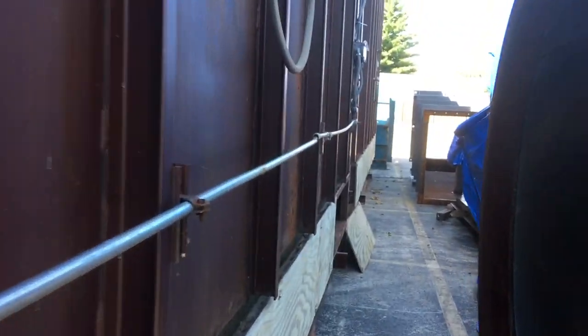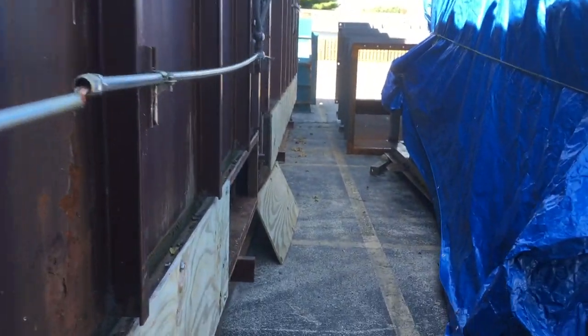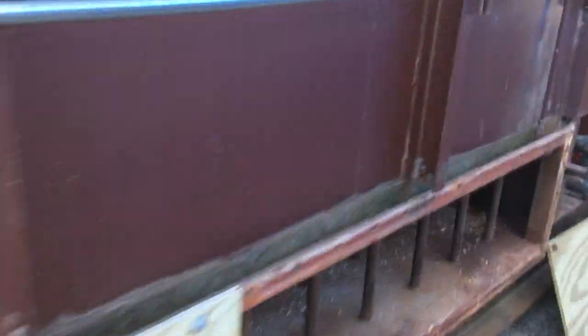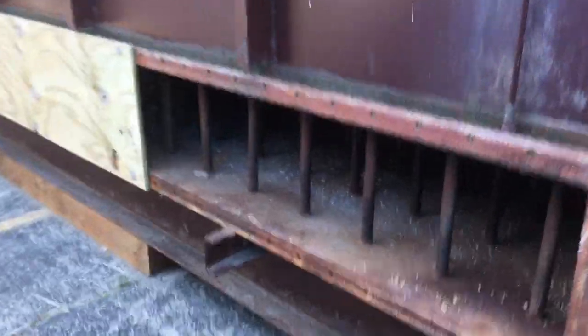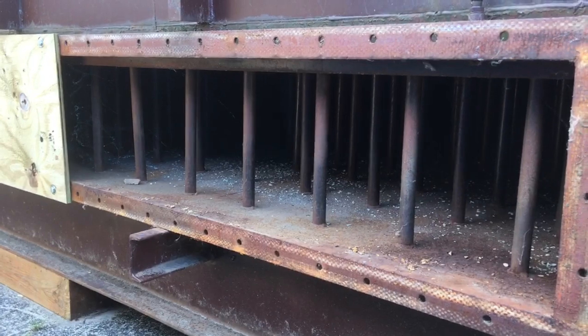I'm going to come down to the area where I have it opened up. This unit would use saddles — ceramic saddles — as the ceramic media for the heat transfer and heat exchanger of this RTO. We're looking at the cold face support.